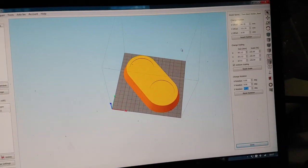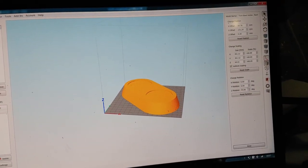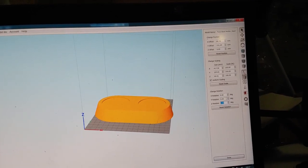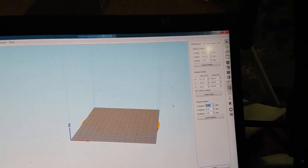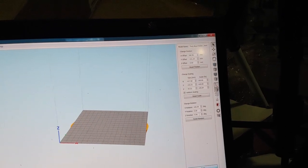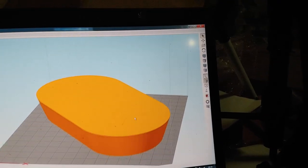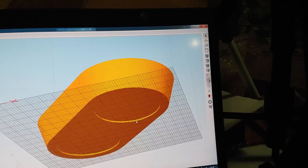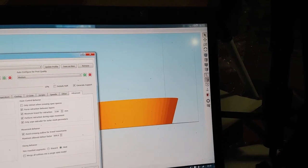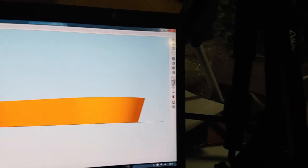It's 417 millimeters wide, which means even on my Chiron I cannot print this straight across, but I can print it diagonally. I'll undo first so I don't get weird artifacts. I take X and rotate it 180 degrees, then center and arrange. Now it sits on the bed upside down, and this here is four millimeters thick.